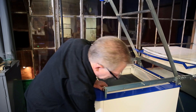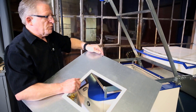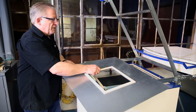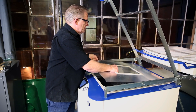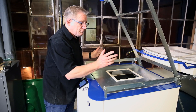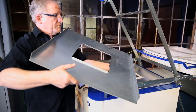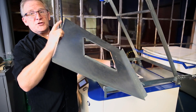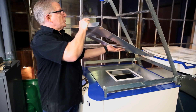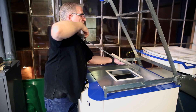Let's start by putting the bottom half of the frame on. You see we have two holes here, and that's going to be where we register this bottom frame. There are no fasteners other than the two that are located in the machine, so the holes go over the screws. When we mount this, it's going to be mounted so that this fastener and its mate on the other side will basically bolt up to this part of the frame right here and the corresponding one on the far side.